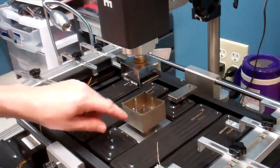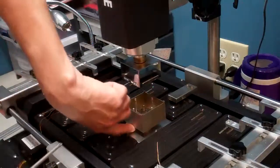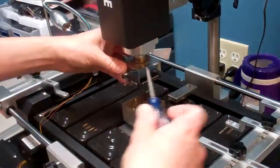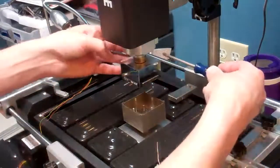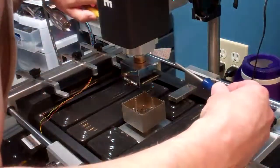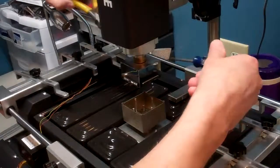you can attach that with an Allen wrench right under the front here, and there's a collar on the bottom of it. Your upper hot air nozzle uses a Phillips head screwdriver. Put on the nozzle you would like, and then using a screwdriver — your best bet is to take needle nose pliers and hold the nut on the back of the screw — and attach it and tighten it up.